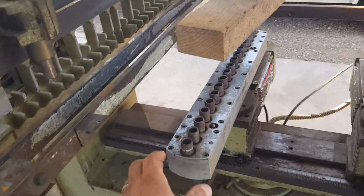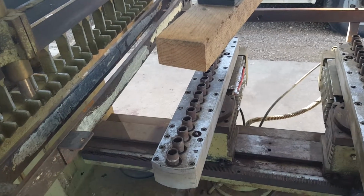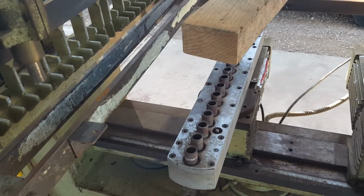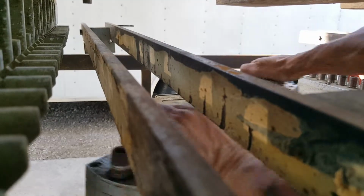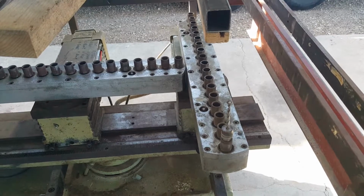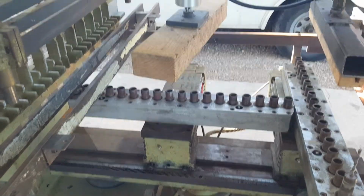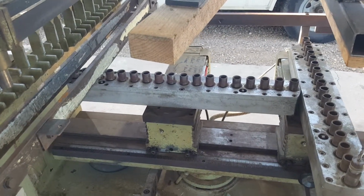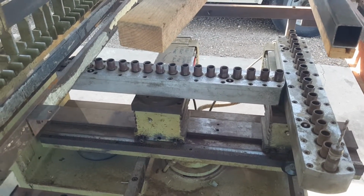One other nice thing about these spindle sets here is that they can turn 90 degrees so that you can change the direction of your spindles. I'm going to set the camera down real quick so you can see that. So now that spindle set is at a 90-degree angle to it. You could also set that one, but there's just probably not enough room. So if you need a set of vertical spindles to go both directions, this is a really nice unit, because all you have to do is do that with your hand. You just manually move it to the other position and it locks in.